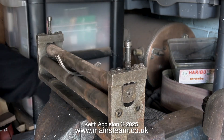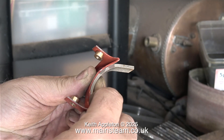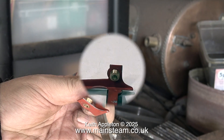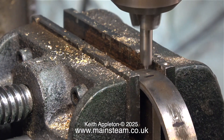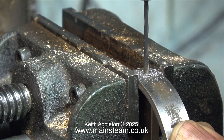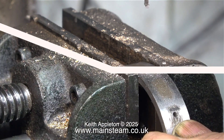The holes in the firebox were not in good condition and the main mounting bracket for the engine components was very loose. After I've cut the piece of steel that I've just bent to length, this will be used inside the firebox to securely hold the bracket to the outside of the firebox. Using my best engineering skills I hold the bracket on top of the piece of metal and mark through the holes using a scriber. Over now to the drilling machine — as always I'm using a centre drill first to accurately position the hole, followed by a tapping size drill for 6BA.